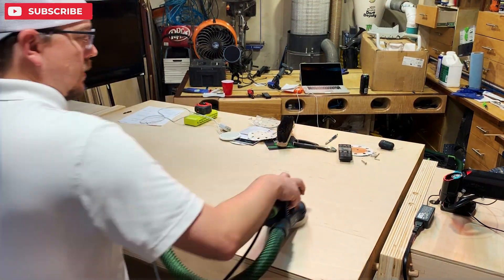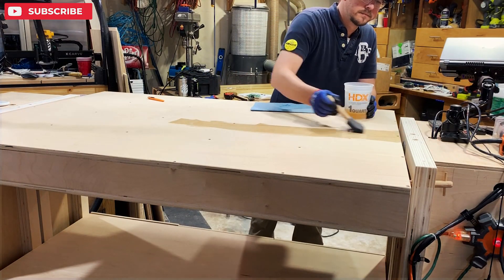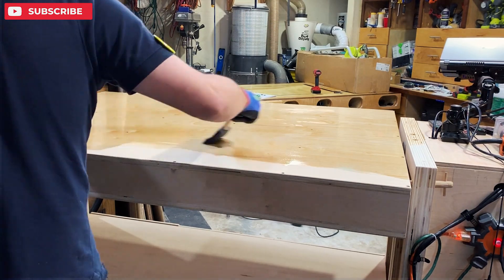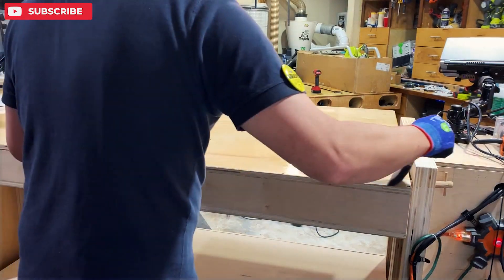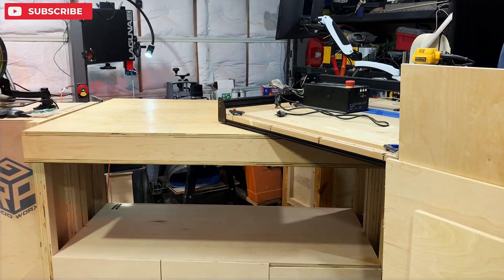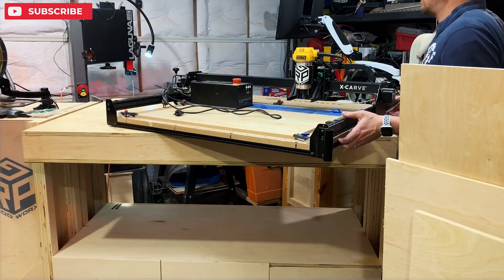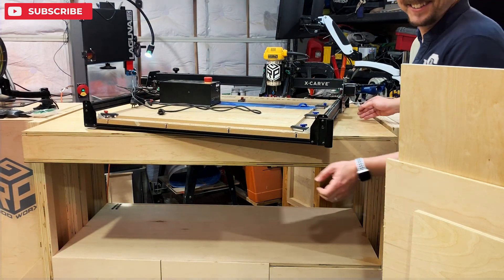I'm going to make sure that it penetrates super deep and I don't mind putting additional coats on — I just want to make sure it penetrates well enough. Sure enough, shortly after making the video, I had some finish left in a solo cup and it dripped through. I thought I'd stained the top for sure, but I was able to sand through the finish and it protected the wood, so I was able to just put some more back on it.